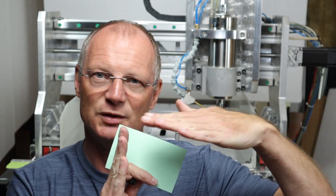So what is my choice — what am I going to use on my machine? I'm going to go with the Panasonic optical switch. The reason is that most of the measurements were within three thousandths of a millimeter. The Metrol high precision mechanical switch I'd want would need to be the one with a side-action configuration, and then there's no difference. I also like the optical switch because it runs directly off five volts as my board needs, and it is not obstructed by any contamination that would accumulate when you machine.